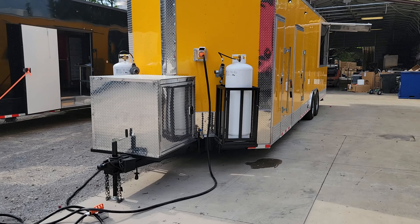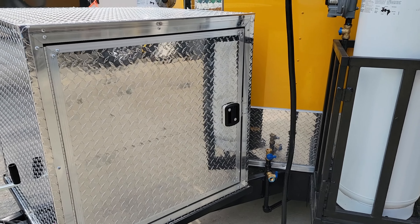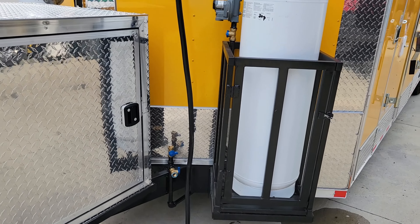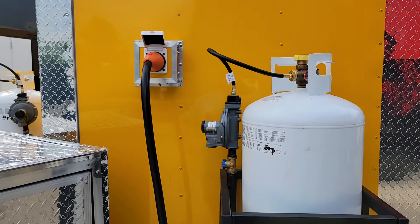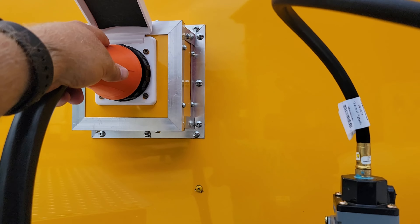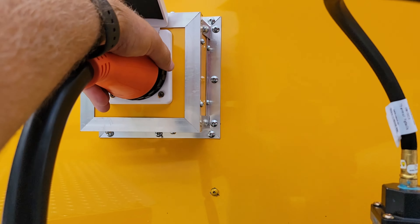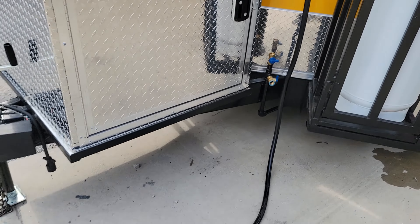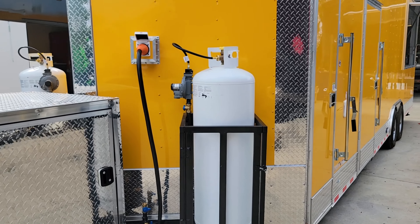Today we're going to start with power supply. As you can see here on the tongue you have the generator box on the extended tongue. Whether you're running off of generator or shore power — for today's purposes we are running off of our supplied shore power. Please make sure your power supply is turned off before connecting to it. To connect, take your plug, line your notch up, push it in and give it a twist to the right, then screw this ring on to secure it in place. Then plug your other end into your power source, whether shore power or generator. This is a 240 volt system, so please make sure that you are safe — it can be a dangerous amount of electricity.